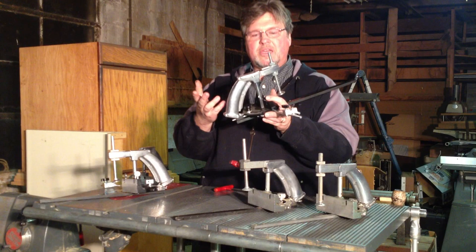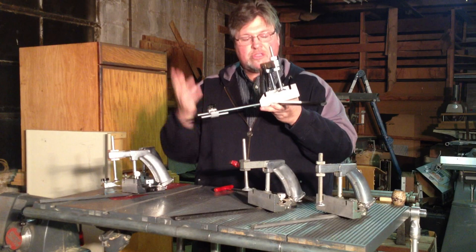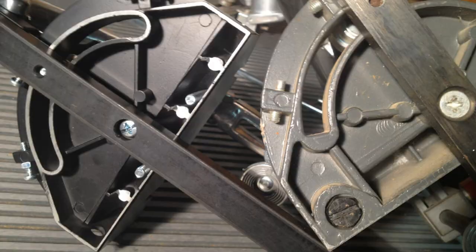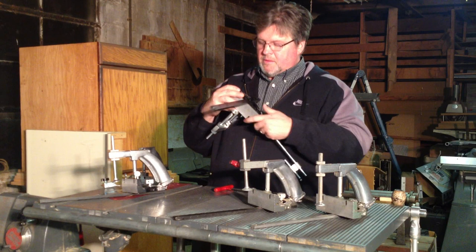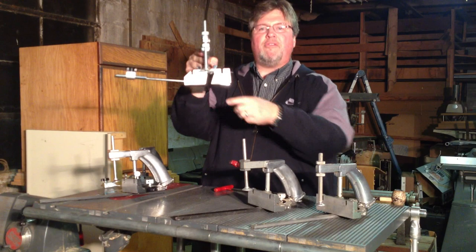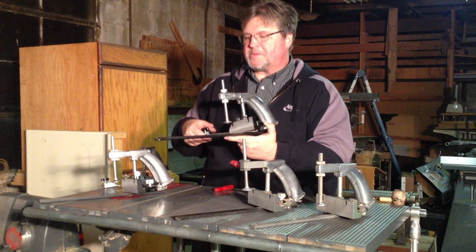The steel knob is missing — this one has a plastic knob. But I thought it was kind of cool because it did include a stop rod, which was an accessory on the ShopSmith miter gauge and is still available today. The more I played with it, the less impressed I was, partially because they use a much thinner aluminum casting, and there are no glides on this, so it wants to grind across my table saw. This is the Woodstock International, which has the threaded rods like the original 1950s ShopSmith miter gauge. Woodstock International is the company — or sister company — of Grizzly Power Tools.